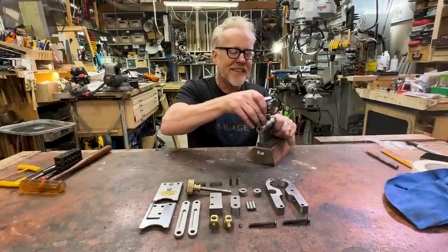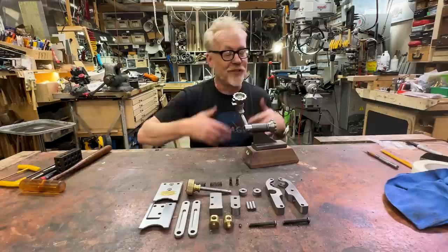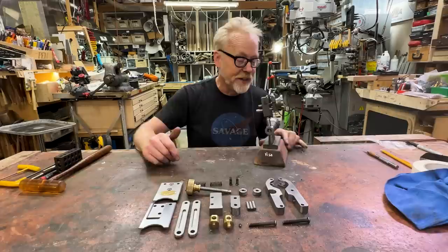They are kits in the real truest sense of the word, because they don't do any of your work for you. You get like a cast iron piece that is not squared and not drilled out or anything. It's just the raw cast iron. And then you get steel chunks for the rest of it. And you get a set of plans, two or three drawings in order to make your parts. And the tolerances are all listed, and there are pictures of it.